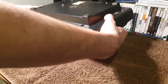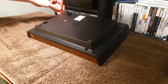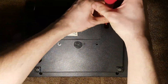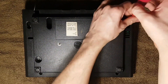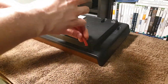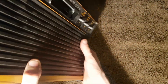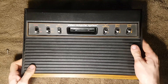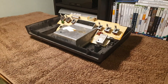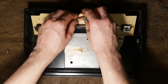It's also stupidly easy to install. First step is to remove the bottom case screws and then separate the case. Then two more screws, the RF cable, and a cable connector to remove the switchboard.